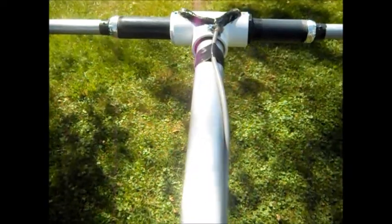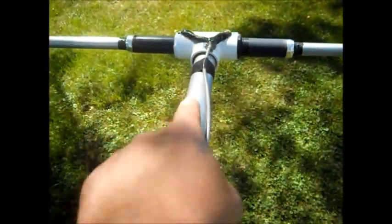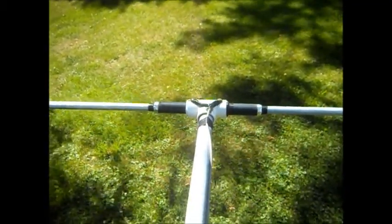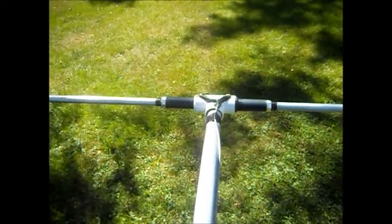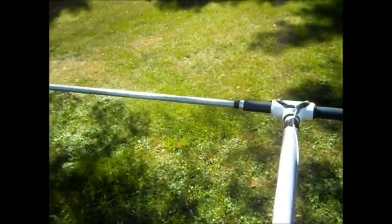We're going to wrap this coax cable about 9 times around the mast up there. The big term for that is it decouples the signal, so the coax does not radiate the signal, it radiates out the antenna. These things are notorious for picking up interference.